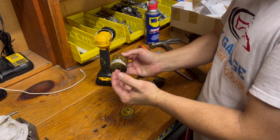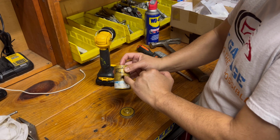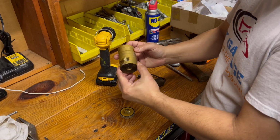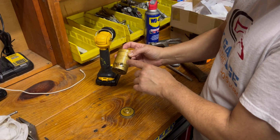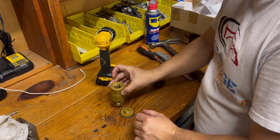So when you have pressure coming in here, it pushes forward, and then it allows more bypass because you're building up too much pressure. And it's building the pressure for this hose here. And this is your fan clutch. And there's tiny little holes, and that's really all you need to activate the fan.